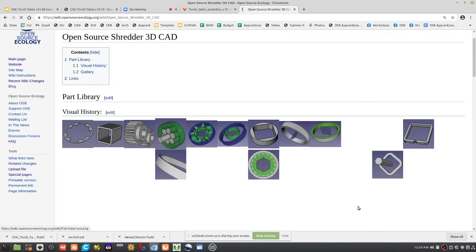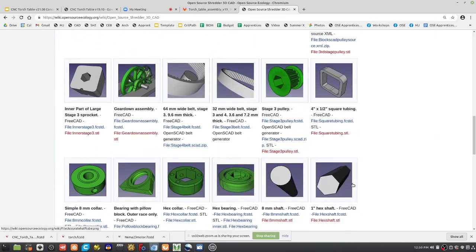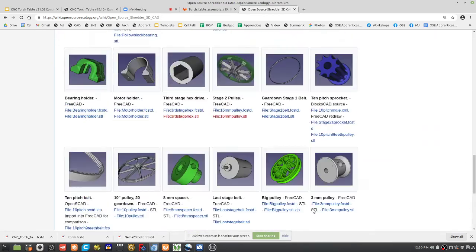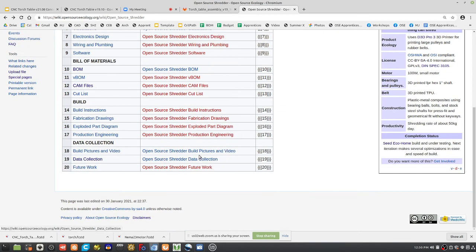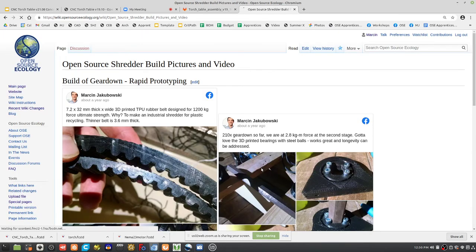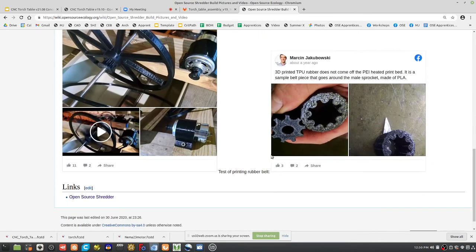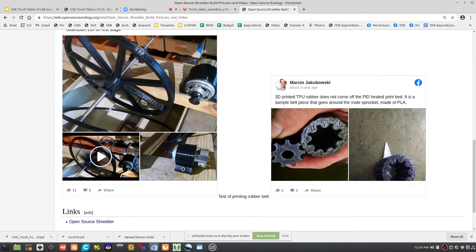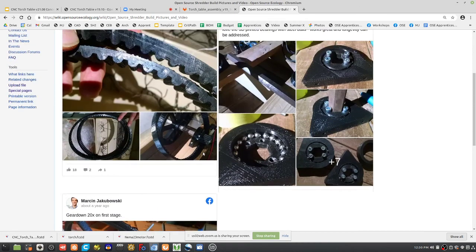You might not notice that this is what I've actually been doing. This is before, using 3D printed belts and gear downs to produce a thing that looked like this. This is a partial prototype, the kind of stuff I've been working on, but this is not what we want to do. The last prototype used a very small 100 watt DC motor with a 1,000-fold gear down.